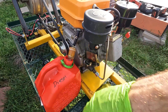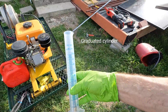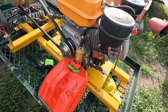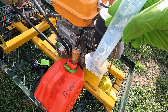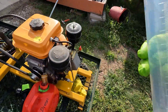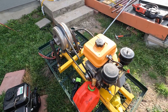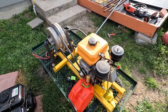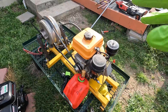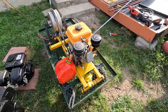We're draining the fuel tank so it doesn't make a big mess - there's no fuel shutoff. The reason I'm connecting this to a test tube instead of just pouring a set amount of fuel and letting the engine run dry is because if you run a diesel dry you have to reprime it. So the easiest way is to get a set amount of fuel in there, get the engine running, and measure from there. We'll use 10 milliliters and I'm probably going to do the test three times per engine to account for any weird variables like the engine warming up.